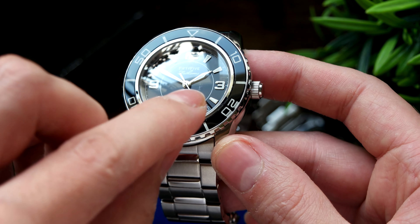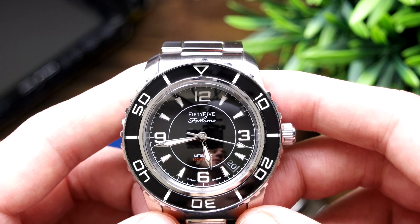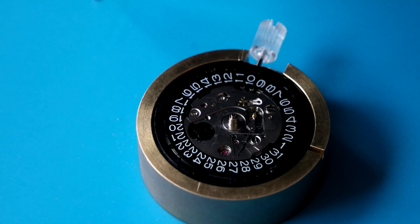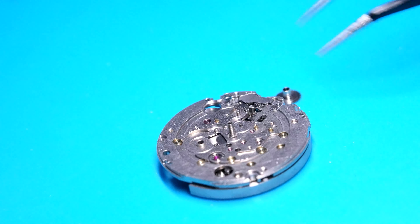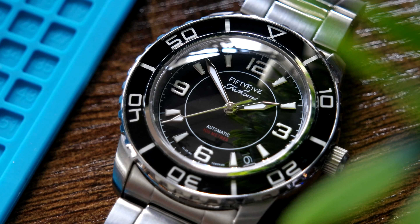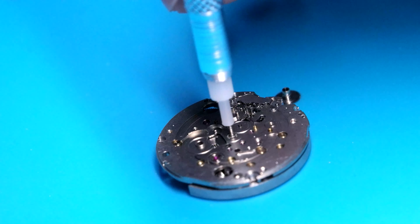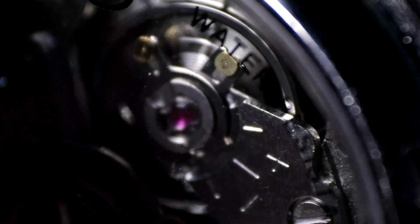At least with this build I can say I salvaged it. After wrecking the dial and getting everything together and filming it all, I wanted to shoot some more B-roll, so I set the time to 10 and 2 — and then the minute hand stopped moving and the gears started grinding. I took the whole thing apart right down to the bare movement. I thought I'd take the cog off the date-changing mechanism and put it on the 7S36, repair that, and put it in there and be done with it. I had it all ready to go, and then when the hands didn't align I pulled them off to try again and the gears started grinding — and I realized it's the post in the middle of the hand seat. It can be pulled up out of position and start grinding, and all I needed to do was use the second hand pusher to press it down and remedy the problem. So I fixed the NH36, got it all back together, and here it is.